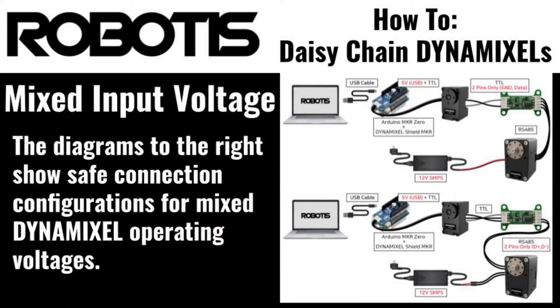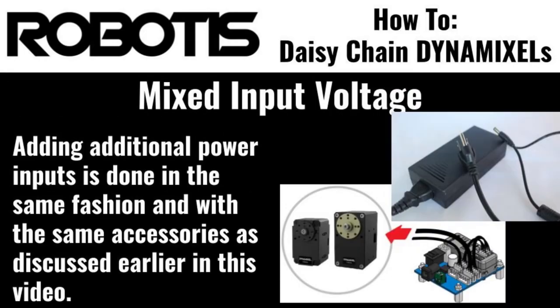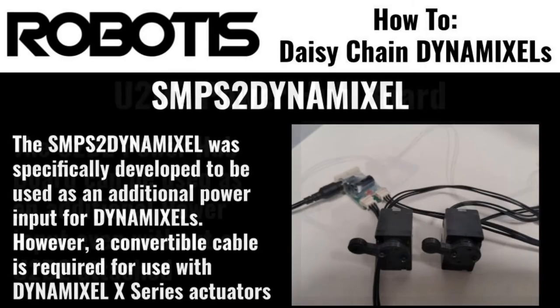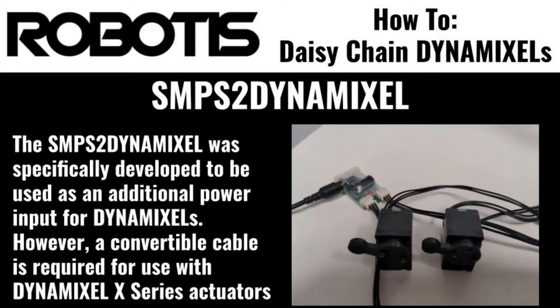After doing this, you can connect the two Dynamixels with different operating voltages to one another using the modified cable. You'll need to add two power supplies to the Dynamixel system, one for each operating voltage. When connected in this way, each section of the Dynamixel network has its own dedicated power supply, allowing the use of different operating voltages in each disconnected section. This technique can even be combined with the Dynamixel Communication Bridge to create Dynamixel networks comprised of mixed communication protocols and voltages working together.